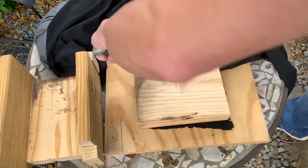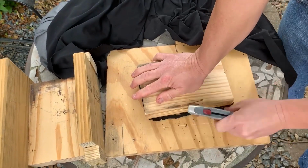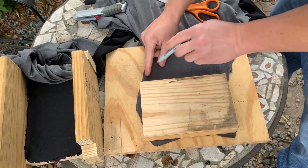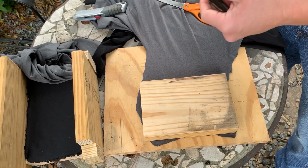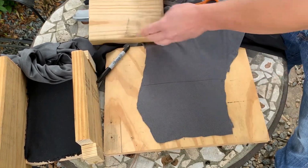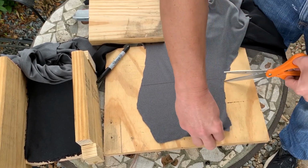So the better way, which is what I chose to do after just one piece with the box cutter method, was to simply trace the outline with a Sharpie, then cut it out with scissors. This was much quicker and made nice clean cuts. Just remember to avoid using any kind of colored marker that would be an undesirable color, as it could bleed trace amounts into your micarta once the epoxy comes into contact with it.